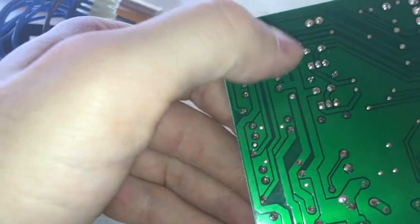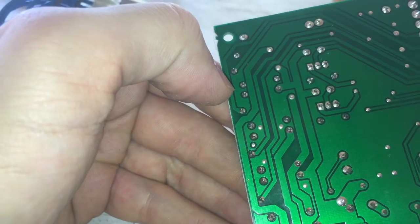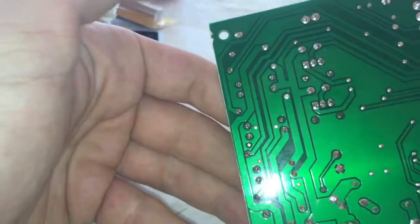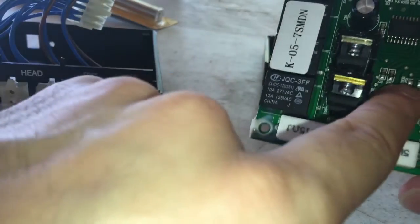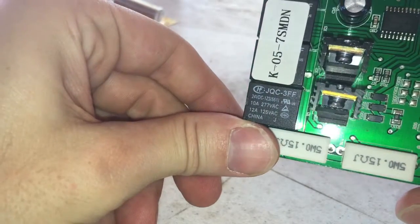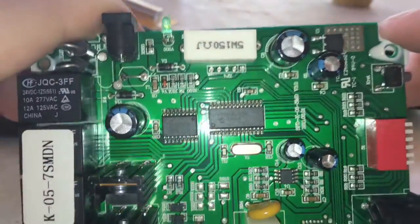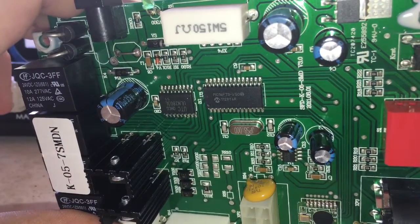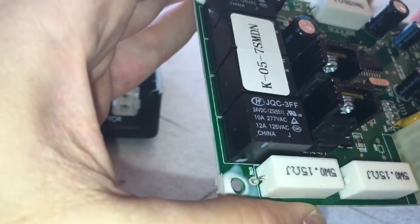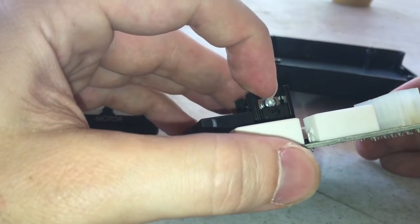And they get connected. It seems like the inputs get connected to the same part. There's 2 resistors here. 102 is the part number for those resistors, and they go up to this guy here, U3, and it's a PIC. So we're going to change the first IRF 530 and see if that takes care of it, because it's directly right into that. See what happens. In order to do that, all you need to do is unscrew that right there.